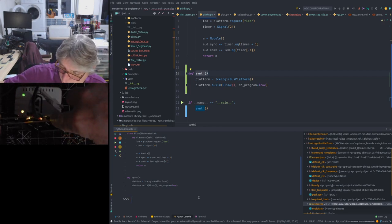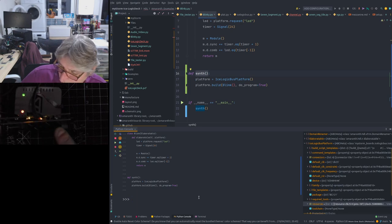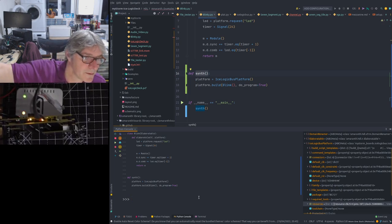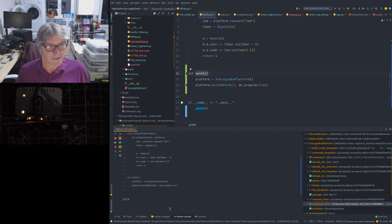So if we look at this LED here, the LED there is for the STM32 side, which is kind of orangey colour. And then the LED for the FPGA is this side. And again, it's kind of an orangey colour as well, although that's not entirely clear. Now, as I said before, the reason that it's that colour is the done signal is being pulled low because the ICE40 is not being programmed. So the red LED part of the RGB LEDs is on, and the green LED is always pulled down to ground because it indicates the power on the FPGA board. I'm probably going to change that, but let's just forget that for the moment. That's why it's orange.